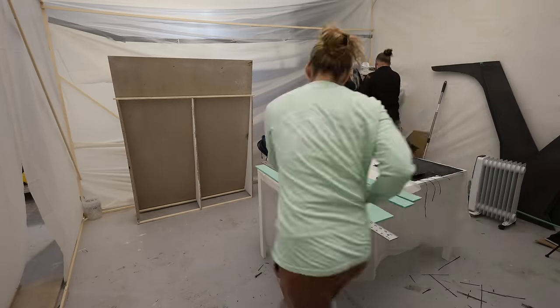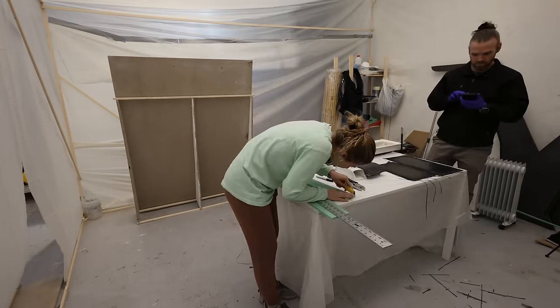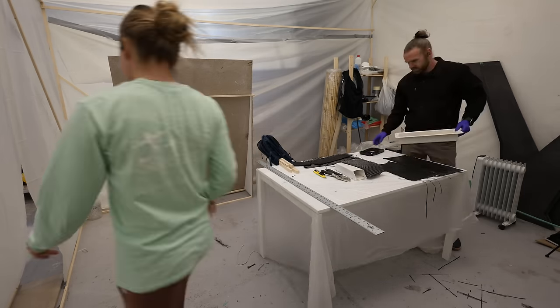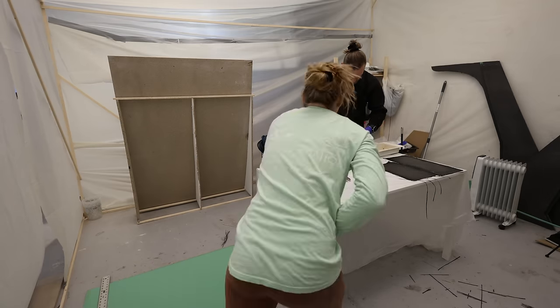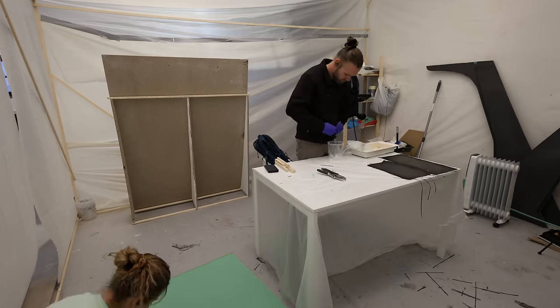There on the corner you can see those two flat sheets of carbon that I made. They cured overnight and I pulled the peel ply off today. Now I just need to pour epoxy on top to give them a nice gloss finish and a little bit more thickness — these are not structural, they are just to look good mostly.